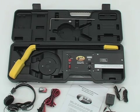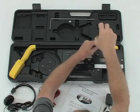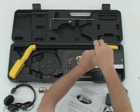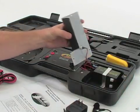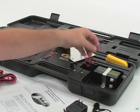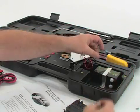The 12-volt battery for the transmitter needs to be connected before the locator can be used. To do this, unscrew the battery compartment cover and remove. Caution: remove the cover very carefully because there are wires connected to the back of the cover that could be damaged. Inside you will find two wires, a black and a red.